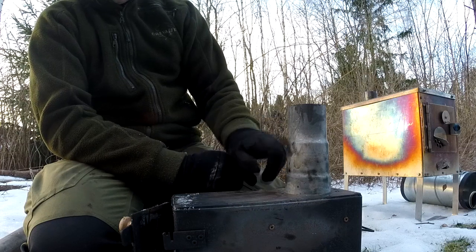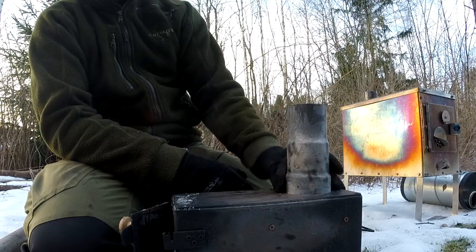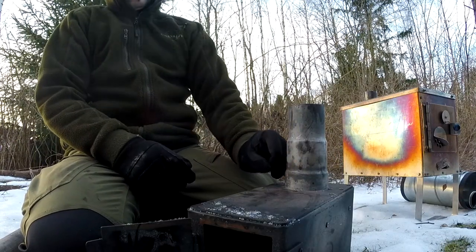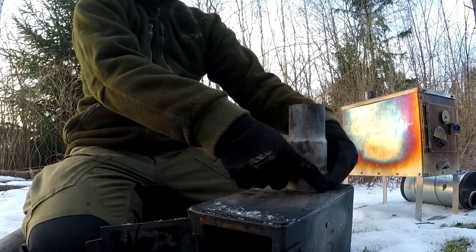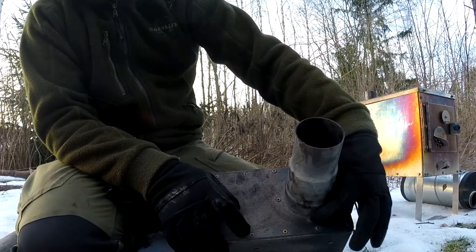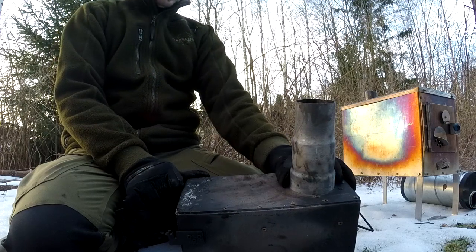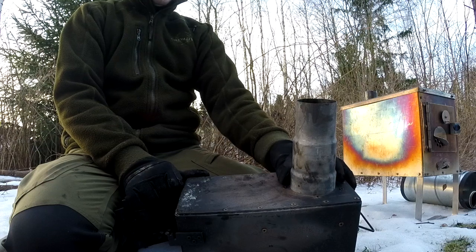This is an exhaust pipe — you can convert it to different sizes, and it's very cheap. The bottom of the pipe connector I cut a lot of slots and bent them out so you get like a star shape, then I drilled and riveted them with stainless steel rivets.